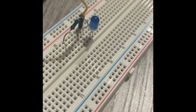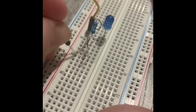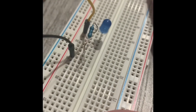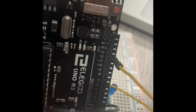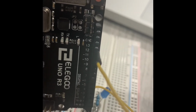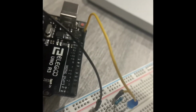Digital input output pins are pin number 13 to 1, as you know, and then the resistor is connected to the ground. If you can see, here are the connections. I've connected the LED to pin number 13. Above 13 also there is ground. If you want, you can connect it there, or I've just connected to the other side. Doesn't make much of a difference.